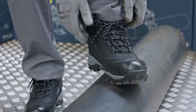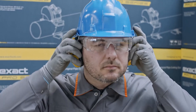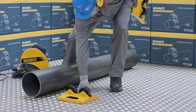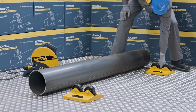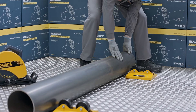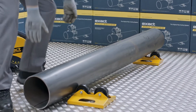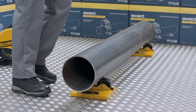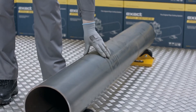Now we will show what preparation is needed before we can start to cut. Always use proper personal protective equipment. Find a flat surface and use supports, rollers or wheels which came with the saw — this will ensure safe working conditions and optimum results. Place pipe supports so that the cutting point is between the two rows of rollers and both pipe ends are placed on supports. Or, when cutting short and lightweight pipes, place the supports so that the cutting point is outside the wheel supports. Check that all support wheels are in contact with the pipe and adjust supports if required.